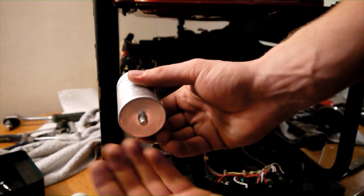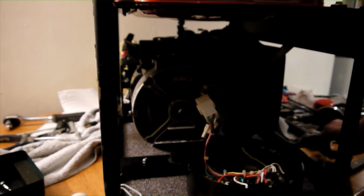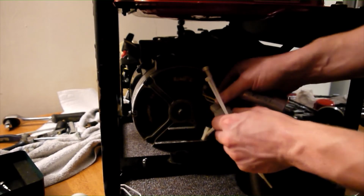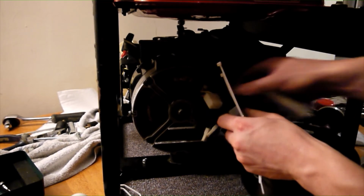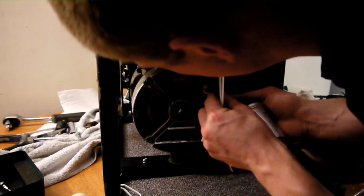The new capacitor is equipped with a mounting stud. Remove the bolt from this stud, as we will not be mounting it in this way, and if the bolt should vibrate free, it will cause unspeakable damage to the alternator should it get caught in the rotor. Disconnecting the socket plate gives easier access into the alternator.